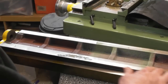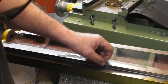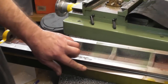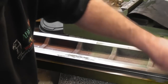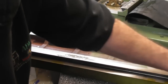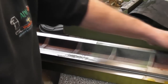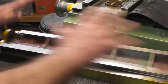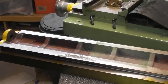I'm going to give it all a good clean down, remove all this overspray. Sharp edges — not too bad on the table actually, but here on this dovetail is a sharp edge, same on the other side, same on this inner edge, outer edges — they're going to need just a light stoning over, just breaking the edges with a stone. So big cleanup, stone over, and then we're ready to put the table back onto the carriage.